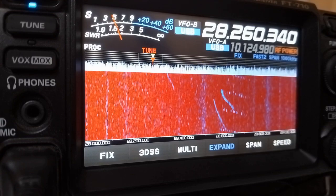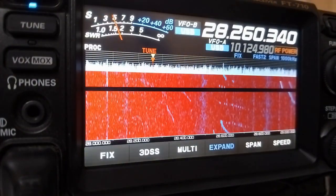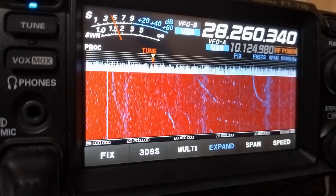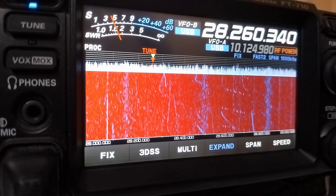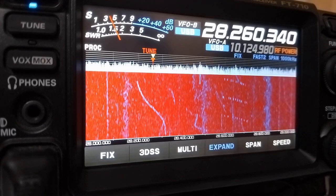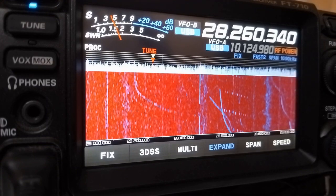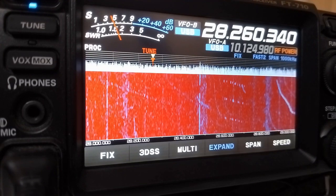After tuning has been done, if you press the PTT you can see that the SWR is quite low. I pressed PTT without audio — I did not want to transmit audio. In SSB mode, without using a tune tone or something you will not get much output anyway. You have seen that it is well below 1.5 SWR.